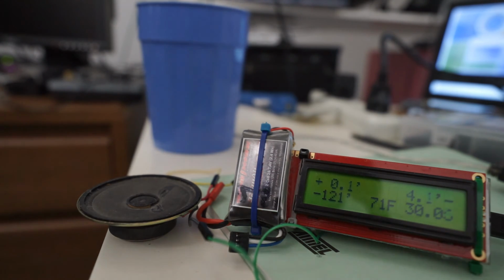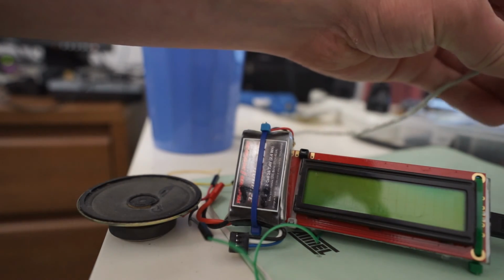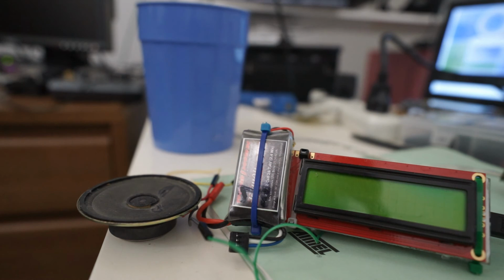But the thing I can't quite explain is right when it first starts up. I kind of have a theory, I'm not sure if it's right, but right when it first starts up, the interval that it's running at appears to be very slow. That's running much more slowly than it does once it's calibrated and stabilized. I think what's happening there, and I'm going to test this, is that I'm trying to drive maybe a negative value into the frequency, or it's just a low value, and for some reason that blocks for longer when you configure it.